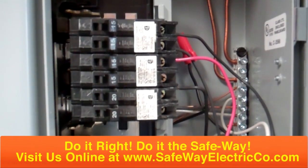I powered down the panel in order to begin my work. One of the first things you want to do is make sure that all power is shut off to your circuit breaker box. Shut off the main power by switching the main circuit breaker off, and always use a voltmeter in order to confirm that the power is off.